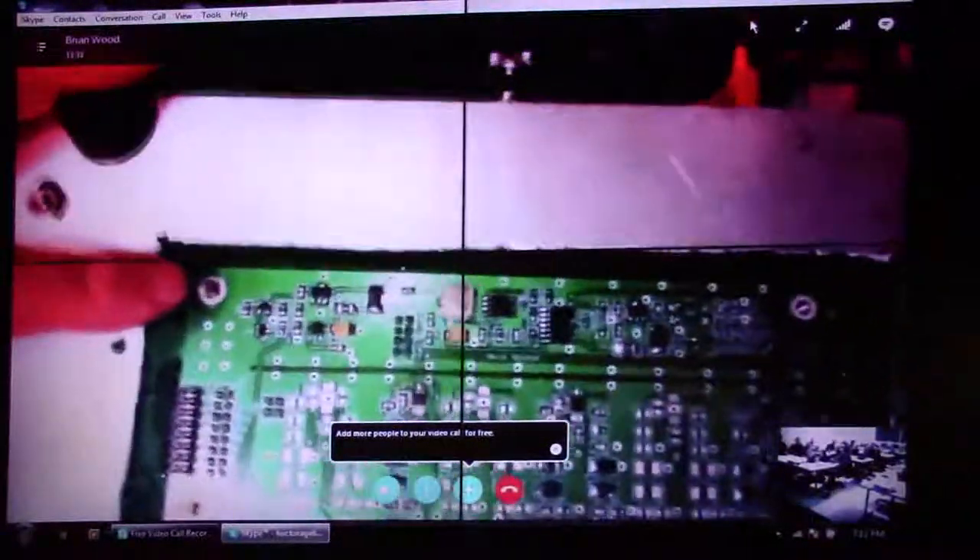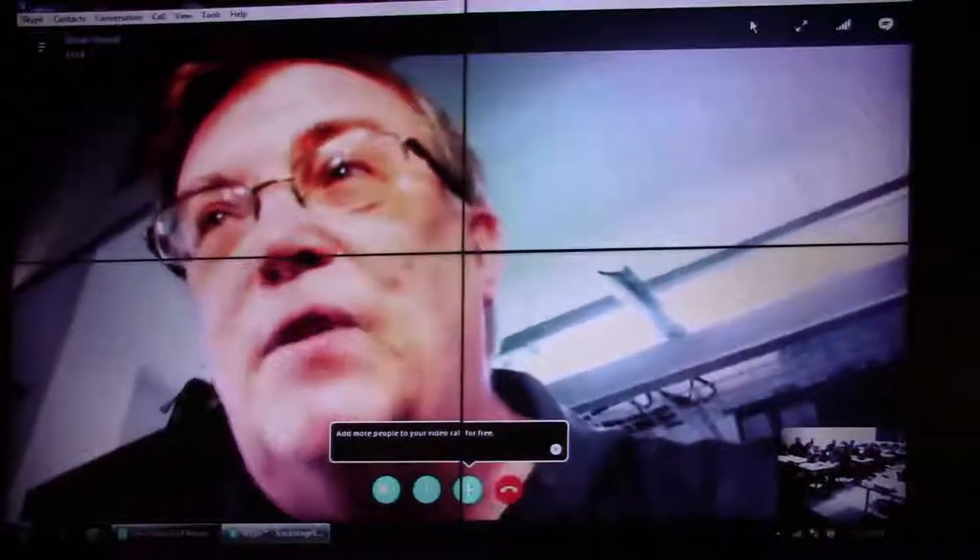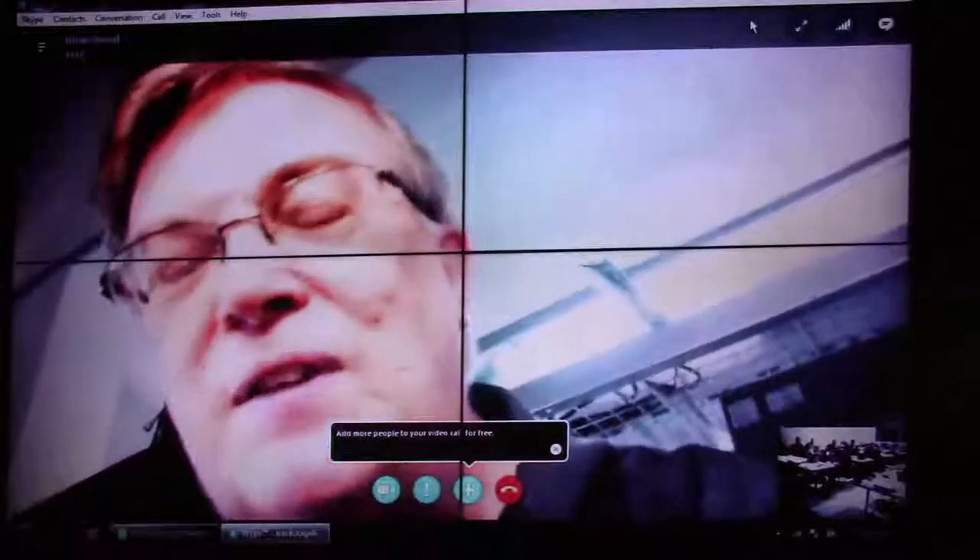When you build the IF filter board, you can get access to it from the bottom. There's the opening for the crystal filters that snap in. This is a prototype, so you're not seeing it in all of its glory. But there will be an opening over here for the bandpass filters and the RF noise blanker. This RF noise blanker is a unique design — something similar has been used in the military. It takes advantage of the fact that you've already got bandpass filters at the front end, so you've got the built-in delay to allow a noise blanking signal to get to the point that it needs to blank before the signal gets there.